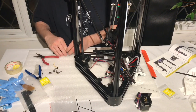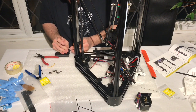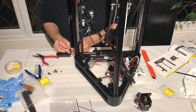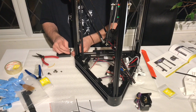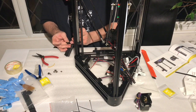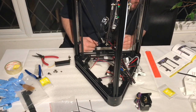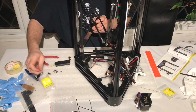After applying the screen, I turned to the filament holder. This has to be placed at a particular height, which you can find in the manual, and by using the included ruler it was very straightforward. You have to attach two T-bolts and two nuts, align, and then place in the extrusion. Measure to the height and tighten.